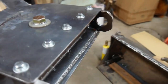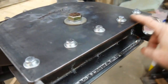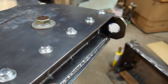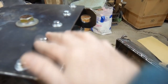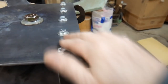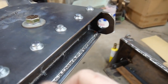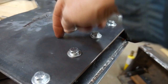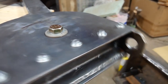This piece alone weighs like 30 pounds – big old piece of C-channel. I decided to bolt it on because it would make it easier if I ever had to replace things, easier to paint. It was harder to do – five-sixteenths-inch bolts. I actually went and threaded each one of these holes. It was very difficult trying to get the alignment just exact because I wanted this to go in at the angle just right. It seems to be really good – I'm pretty pleased with it.